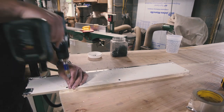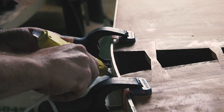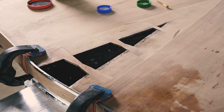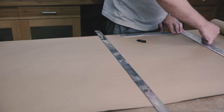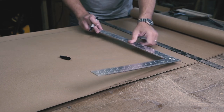Coming back the next day, I lined a board with foil tape and screwed it to the underside of the tabletop. I used hot glue as sort of a caulk, though in hindsight I should have used silicone. I poured another batch of thickset and waited. I had a few small leaks here too, but it set fast enough to dam up the gap so I could come back and top it off later. With epoxy curing, I could turn my attention to the base.